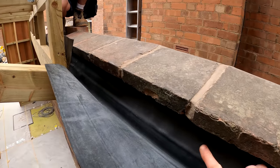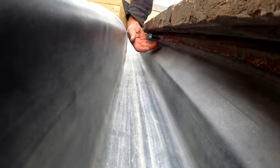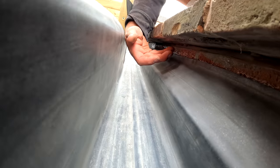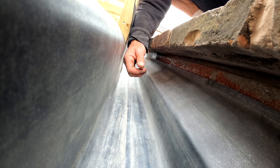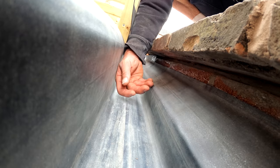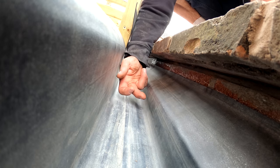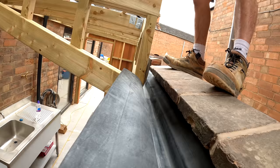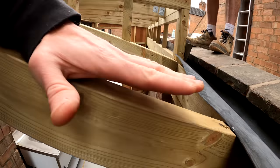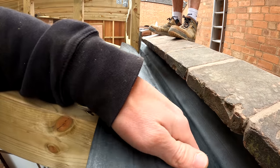So you're going to put some lead in here though, aren't you — just under these copings? Yeah, so if you look just under the copings with the angle here, we're going to get John and Phil to grind it out underneath these copings for me. We've got to get some lead into here, dress it all the way down, just above the flat, giving ourselves plenty of cover. That's going to be tomorrow's fun job. And then our polycarbon roof is going to come across here, sit over there, and there'll be a small drip detail at the end just to carry any water off the roof straight in.